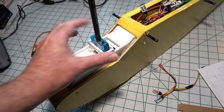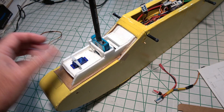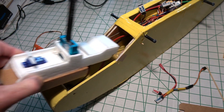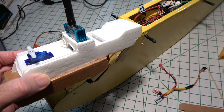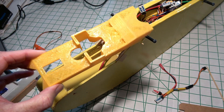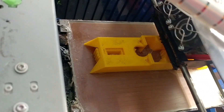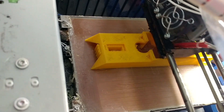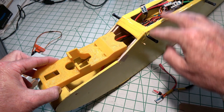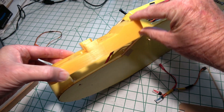I got that located about where I wanted it. This is for the pan right here, which will probably also have a tilt servo later on. Once I did that, I turned it over to my son John to make a 3D printed version. This is PETG filament that was used to print this — he wanted to try that out, so I got him a roll of PETG. We were going to make it out of ABS and just went with PETG instead. That works the same way — it slides underneath this support right here but above the tray, so these little notches go above the tray and kind of clamp it in there.